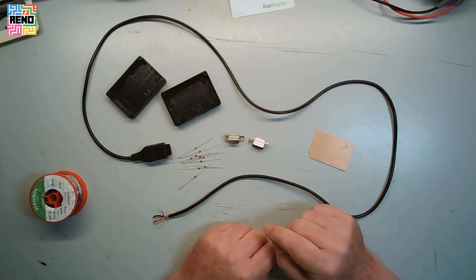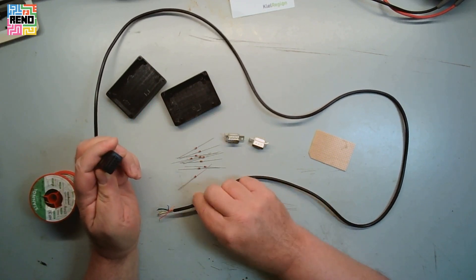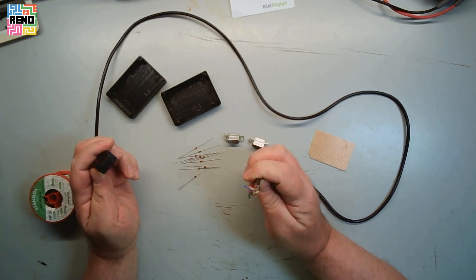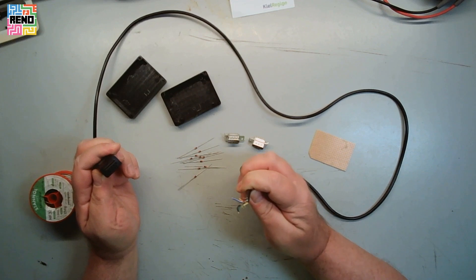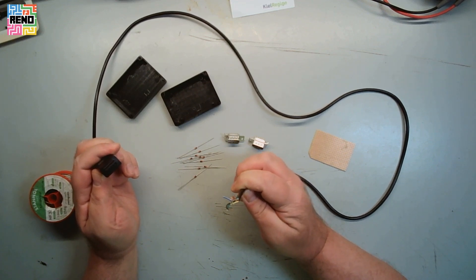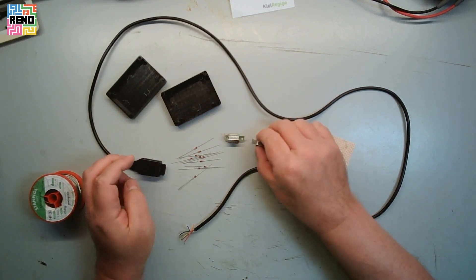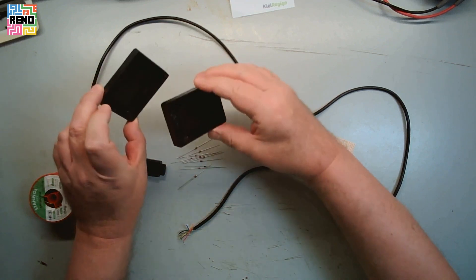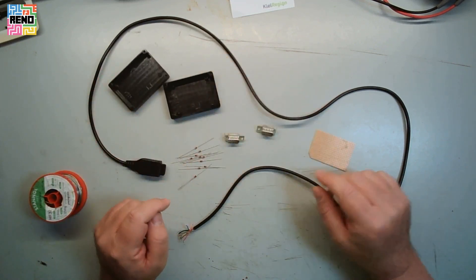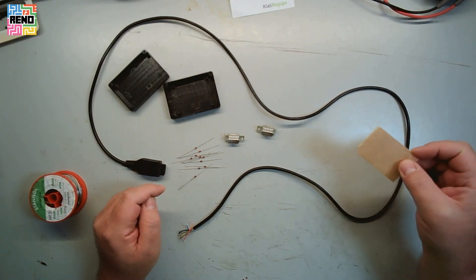Here are the parts I'll be using. First, an old joystick cable — a joystick cable with all nine pins connected. This is important because you need some pins that aren't needed on Atari joysticks and often are missing in the cables. Then two DB9 male plugs, a little plastic case, ten diodes, and a spare piece of breadboard I had laying around.